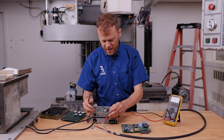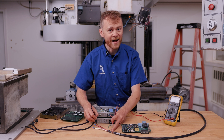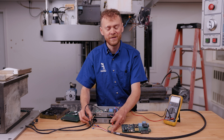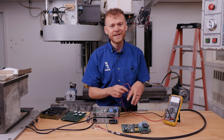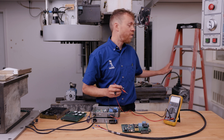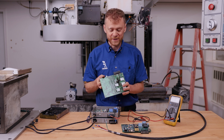The last check is to ground, and I want to be sure that these are open to ground. If you measure anything to ground with your ohmmeter, that's a really good indication that we need to use a mega ohm meter and check the resistance. Because if your ohmmeter can see it, you've definitely got a short — either a short in the cable or a short in the motor. Either one of those could cause an amplifier to blow.